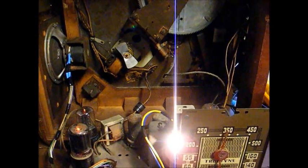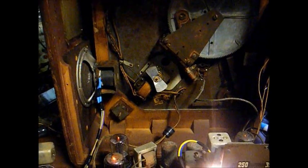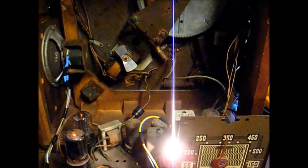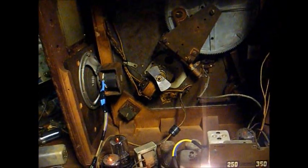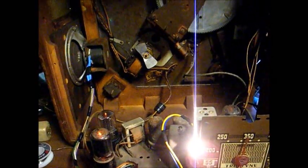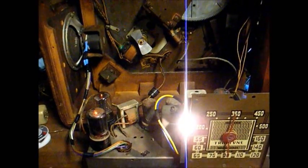I've done about all I can do. I went back to the original speaker, temporarily patched up — it will be reconed one day. And I upgraded the filter capacitors as per the second schematic diagram: instead of two 30s, I used a 68 and a 33 microfarad. And I re-soldered a few questionable cold solder joints from the factory. Hopefully that'll take care of the problem.